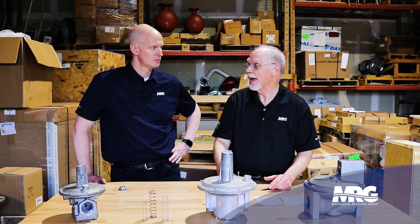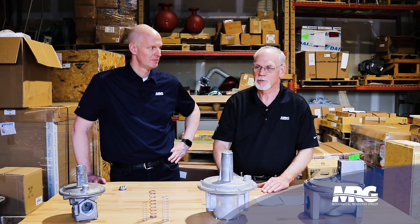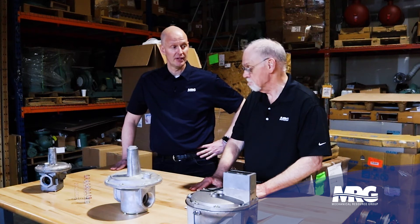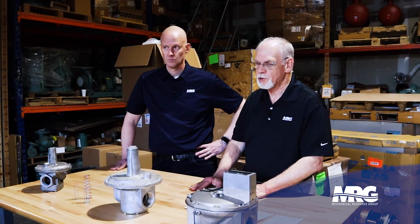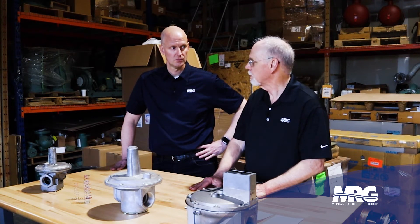With appliance regulators there's lower pressure coming in and less area to contend with in the piping system. With a line pressure regulator, you could increase pressure down a line, which could be very dangerous — an over-pressurized gas line in a building is a serious hazard. Many insurance companies won't allow certain pressures inside a building. On larger buildings with rooftop equipment, they'll put gas piping on the roof and use higher pressure with smaller pipe, which is more cost effective. Above about 15 pounds, all pipe must be welded.